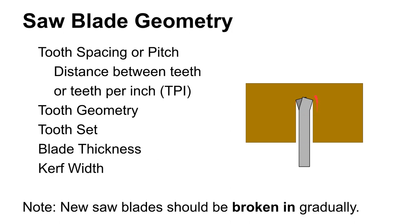The tooth set — you can see it pretty plainly in this image. When you take a saw blade, you don't just cut in the profile of the teeth — you also kick the teeth left and right. What that does is make the kerf width a little bit wider than the saw blade itself. That prevents the saw blade from rubbing and reduces the friction throughout the cut.